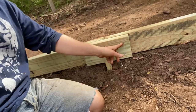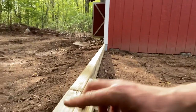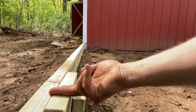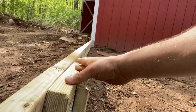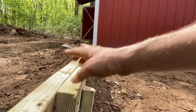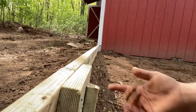The plate, as you can see, I've added my extra bolts all the way around. And I kept it plumb. So I made sure that I followed the line. I made this straight all the way down. I made sure that the level was back on point. So we leveled it to load this. And now we did a double check on the level. We leveled it to make sure we could put the plate on, make sure that we were running true, make sure that we squared up. And then I did a second check on the level, put the stake in, made sure we stayed true, and then bolted it all up.